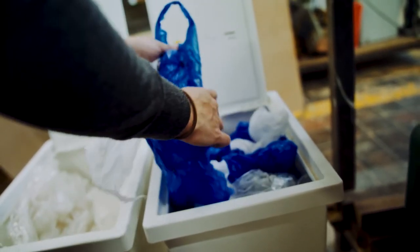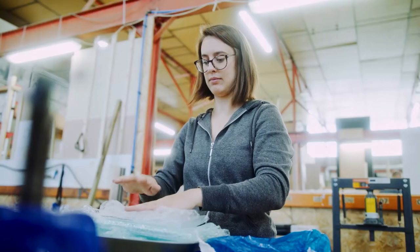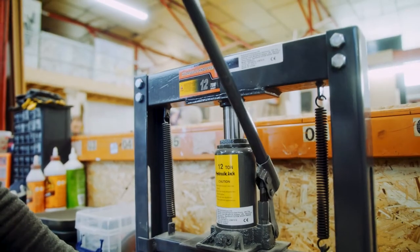With my plastics recycling, it's low density, so it's all the stuff that's kind of stretchy and flexible. The process is that I put bubble wrap and plastic bags on a baking tray, put it into the oven and melt it — it shrinks in size. Then I mold it into a ball, put that into a hydraulic press, compress it with lots of pressure, and leave it there for about 20 minutes. What I end up with is a beautifully compressed material that is nothing like bubble wrap or plastic bags — it's a totally new material in itself.